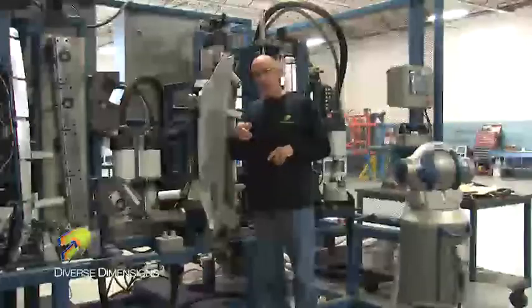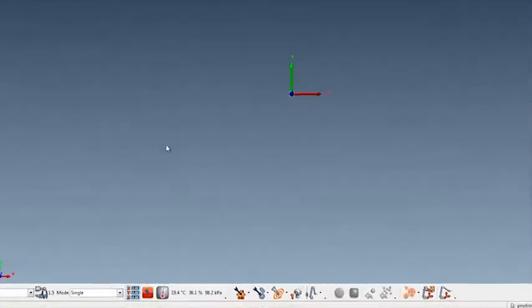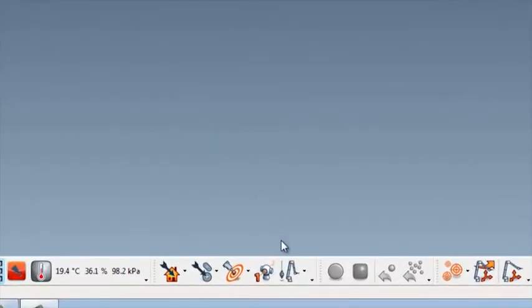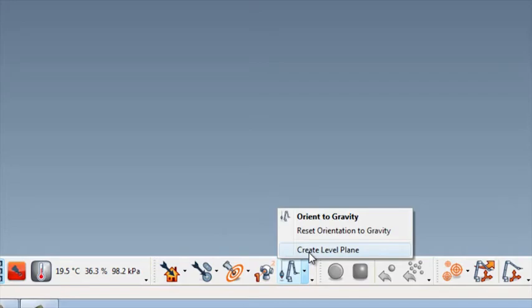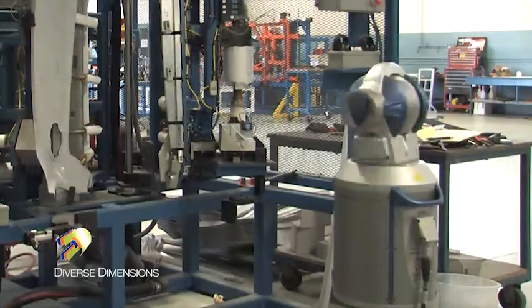Come into PolyWorks with me and we'll take a look at it. We have an empty workspace right now — it's not titled, and the model tree is bare. Since I want to establish my gravity plane as a starter, that's a perfect primary foundation to this measurement session. We're going to come down to this icon right here — I'm already talking to the tracker — hit that little down arrow, and go to 'three-level plane.' Notice what's happening with the tracker: it's going through some movements.